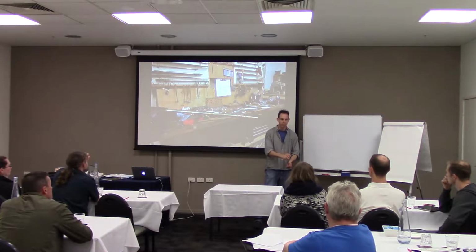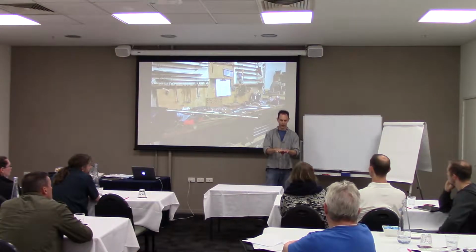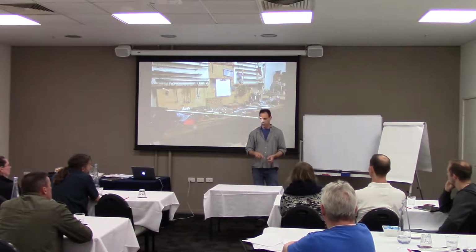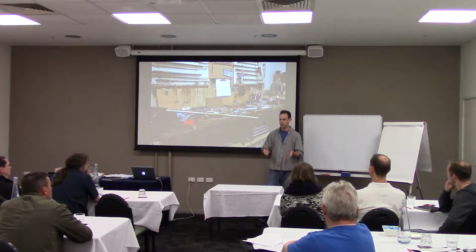Then just take your rawhide mallet and start tapping down one side so you get a straight edge on one side, tap down the other side, and you'll be amazed. It just kind of goes, ooh, and it wants to meet up, and you're like, oh, that's great. Then what I do is I wire it up at that point, and then I go ahead and braze. It doesn't have to be a complete circle, just get those square and meeting.